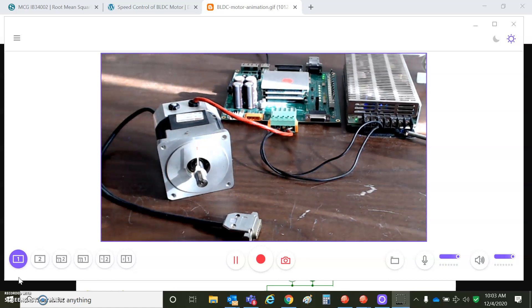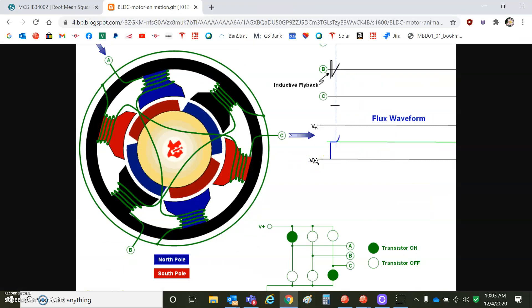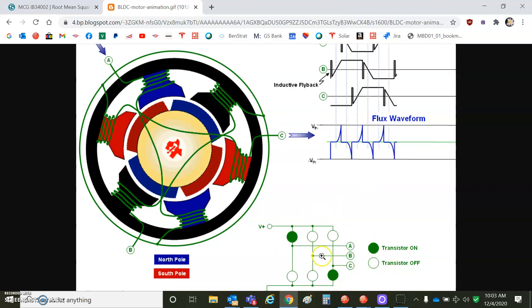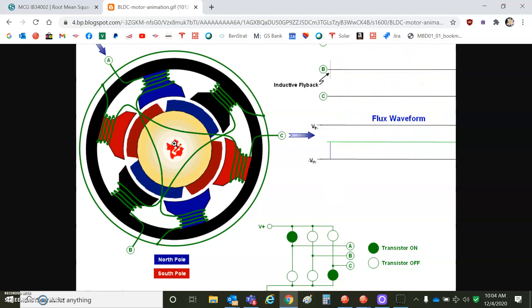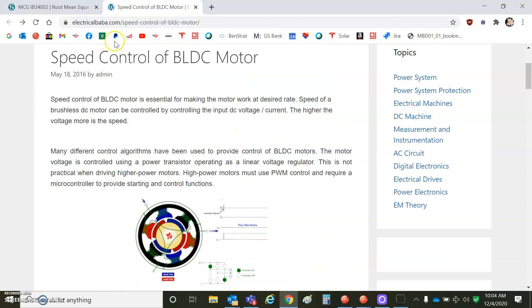It's important to know the electrical cycles. We're going to drive this in an open-loop way. I found a really cool image of open-loop control of a brushless DC motor — it's a TI image. It shows the FETs being switched open-loop to a brushless DC motor with magnets on the rotor and coils to produce the electromagnetic force, doing the trapezoidal waveform. This motor is actually designed to be used with Halls or an encoder for figuring out the commutation, but today we're going to do it in a pure open-loop manner.